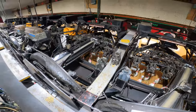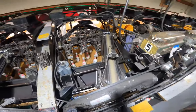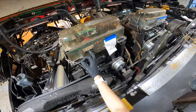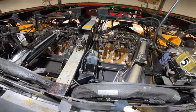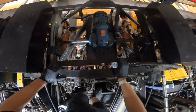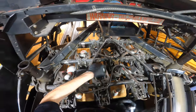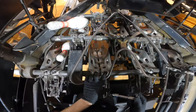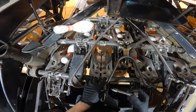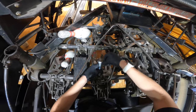Alright guys, so sorry if it's a little loud, we have a few people bowling, but I've dropped the sweep, I've turned the power off to the machine, and now we can enter, and we have to change this one, it's the 9 pin. So basically you just want to remove these 4 screws that screw the cup into it.